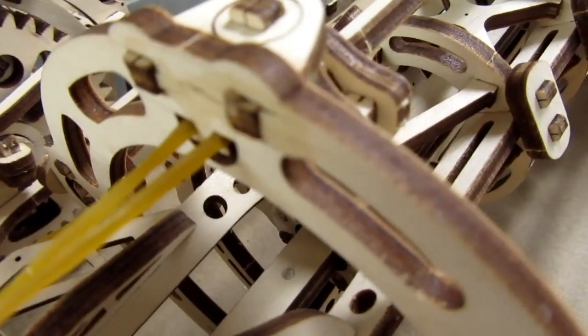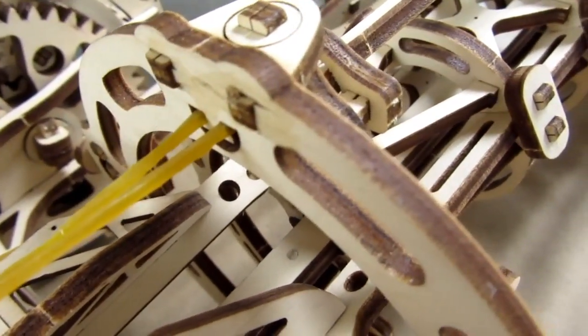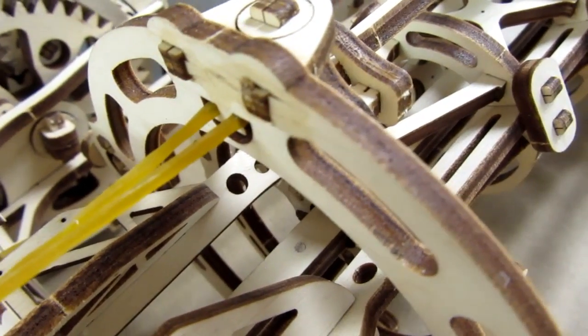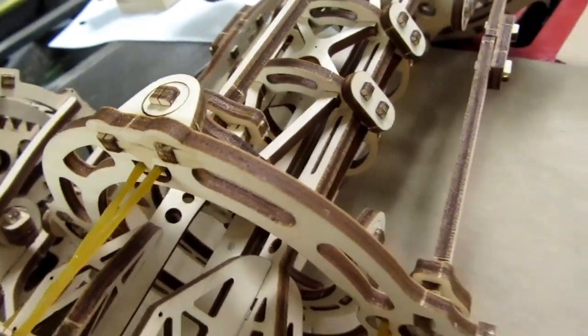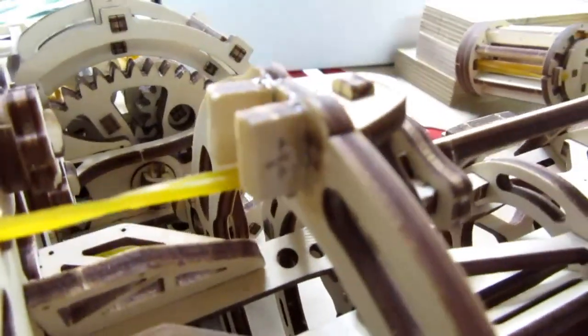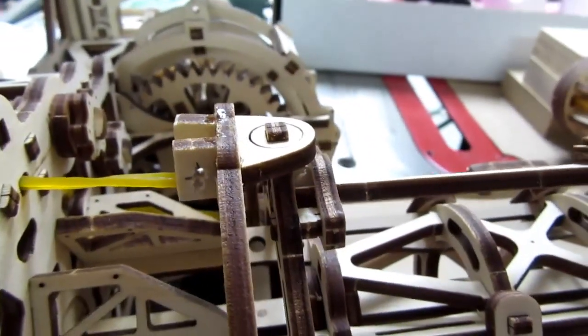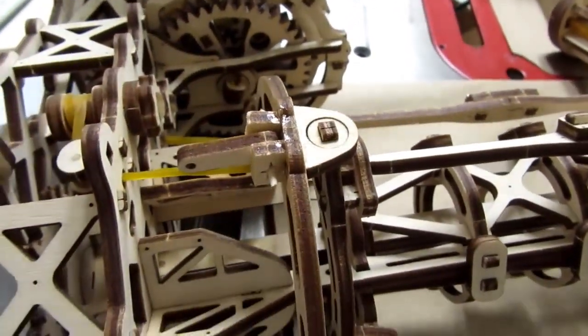So how can I fix this? I'm thinking I just get out the Dremel tool and cut these tabs off and make sure this pillow block is glued in with super glue, and then make a couple of new blocks that replace these guys and just glue right onto the bottom of this big round piece here. Then drill a new hole through that goes into this piece and mount it that way. That's the only way I can think of salvaging this. Well, hopefully that'll hold.